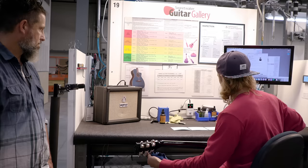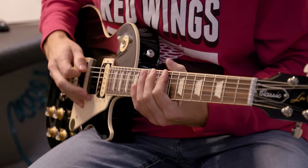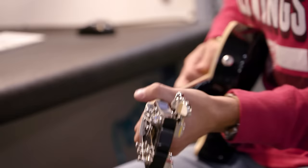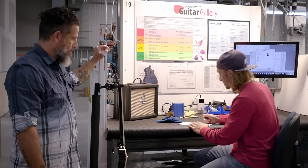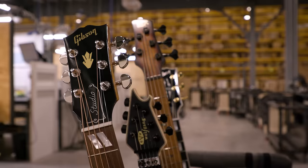From there, I'm just gonna go through and play all the frets. I didn't hear any weird sounds or any dead frets, so that's good. From there, I can go through all the controls and make sure all the electronics work properly. And then this is where I start the polishing process. I'll take a rag, spray some guitar polish cleaner on it, and go through as well as I can to get all the fingerprints off. Then I can go back to the card, sign my name as the final inspector, grab the guitar, and send it to the Reboxer.